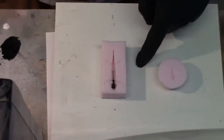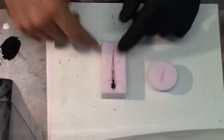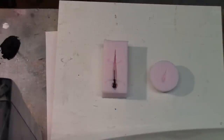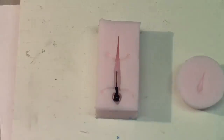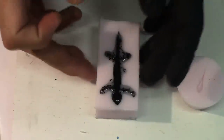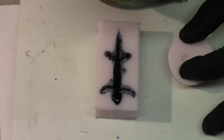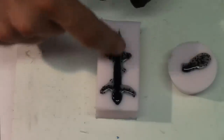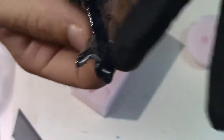I might need to make a pour and then not use it — just pull it out — and that way the mold heats up a little bit so the plastic can run into all the crevices easier. So now I'm just heating the plastic up really slow in 15 second increments to get it to the right runny consistency. It's close, probably one more. I'm probably not going to be able to use that, but that definitely heated up the mold good enough to where I think the second pour will go good. I think for the second time around I'm going to pour the arms first and then spread the tail and go up. This definitely isn't going to be professional results or like clean injection molding, but I'm working with what I got. It looks like it filled out okay around the head. Even the arms are pretty well filled in. I just have all this overspill because I think the silicone is too cold and it stopped it from running nicely.